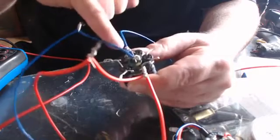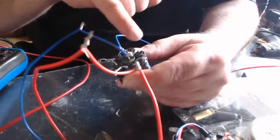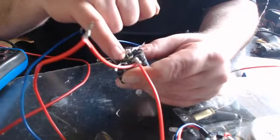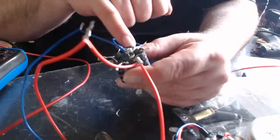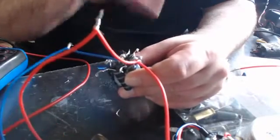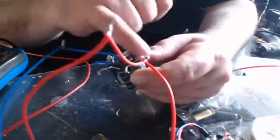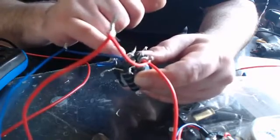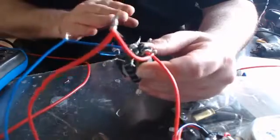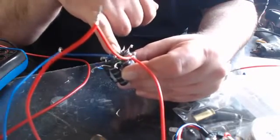Advanced here, very easy though. These are the negatives that are connected together. Remember, these are the positive. Here on the negative side, if I plug a diode from the center plus to here, it will connect to that one there. And we know that the center goes up to 8 volts, so 8 volts will want to transfer to 2.7. The extra here is too much. We could bring it to 2.7 volts, or we could bring it here to 5 volts. These two places would ensure that the energy is transferred. Theoretically, two places is better because it's 3 caps in series, so at least 2 of them will be charging in a balanced state. But even if it's unbalanced, it's going to function just as well, or 10% less than if it was perfectly balanced in certain areas, and not all.